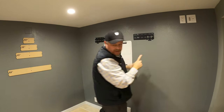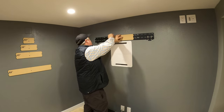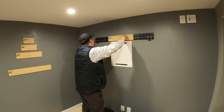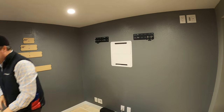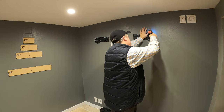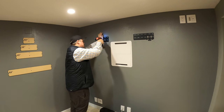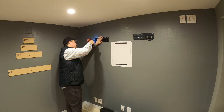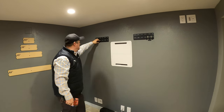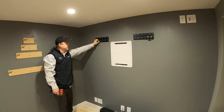Center to there — and we've designed this so you can take your tab here and your tab here and confirm your measurement. Mark your center, tap that over — now you know that's perfectly dialed in. Tap that over — those are absolutely perfect. You don't need to level these because there is enough leeway in that. Press and hold — boom. That one's done. Press and hold — done. Those wings are mounted. The last little trick: pull these out just a hair. That thing is literally ready to install a Frame TV.